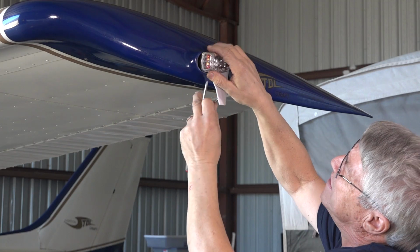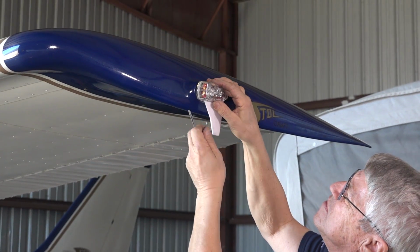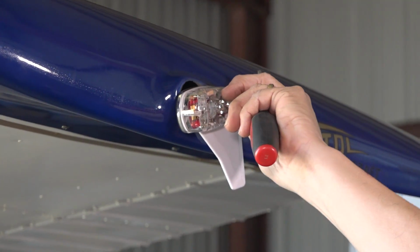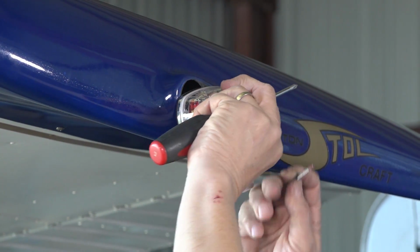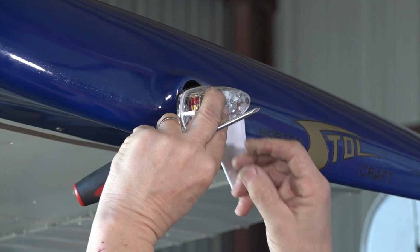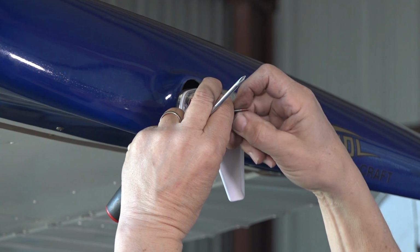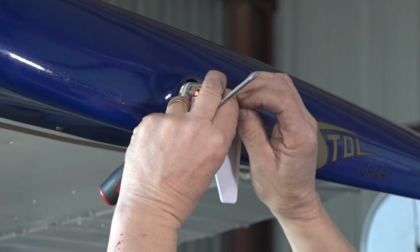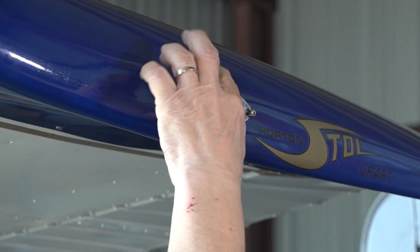We'll put up the skyBeacon. Make sure the rubber gasket is on there first. What's important here is that there are 6 little O-rings in your kit. You put 2 of the little O-rings on every screw before you put it into the receptacle on the aircraft. So you'll have all your O-rings, which will seal that screw and seal the skyBeacon from moisture and security into the holes.